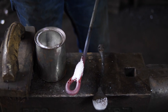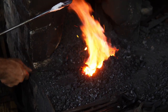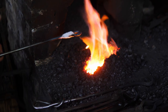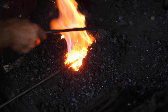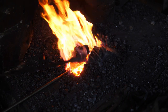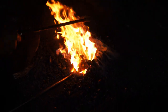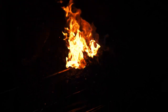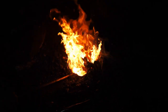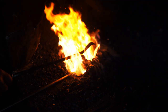That is the whole concept of forge welding. When you're forge welding, you want a tightly packed fire — the forge pot should be full of nice, clean coke that is burning. You don't want it hollowing out, as that's going to cause extra oxidation. You want a nice, even heat. I'm going to set this right in the hottest part of the fire and take some pieces of coke and cover it over loosely. I like to keep a bit of a window so I can see my piece of steel and watch it come up to temperature. You want a clean fire for this: tightly packed, lots of nice coke, and no green coal, which will contaminate your pristine environment.